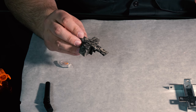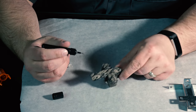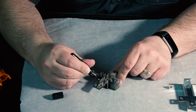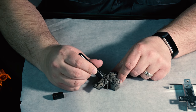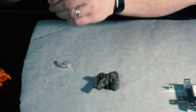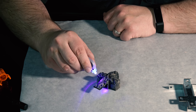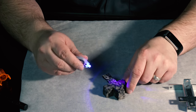We're going to do a few layers to strengthen this thing up. We'll add a little more, try to get it around the edge and the crack, and over here on the other edge as well. We're going to layer this up so it sort of builds up strength — hitting each side for about eight to ten seconds to make sure we really get it cured.